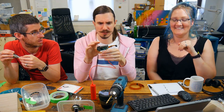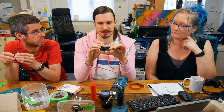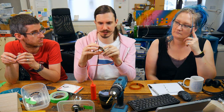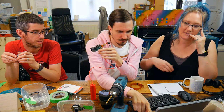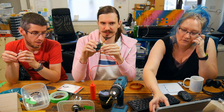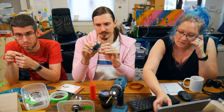So there may be a way that we can integrate functionality from buttons and stuff actually into the code. We'll have to have a chat about that sometime. The idea is that button shim will now snap a photo when the A button is pressed, if I remember correctly. Do you want me to connect this one? Yeah, please. Okey-doke. And the B button will arm the camera and start recording, and the C button will disarm the camera and stop recording.